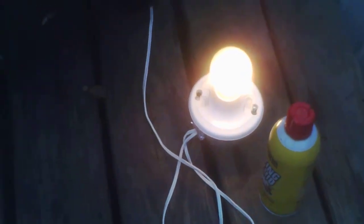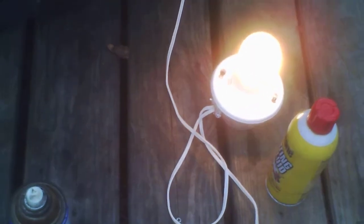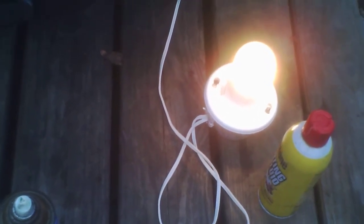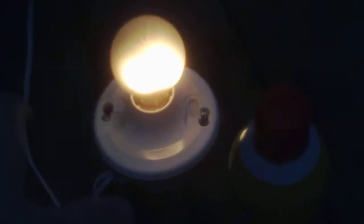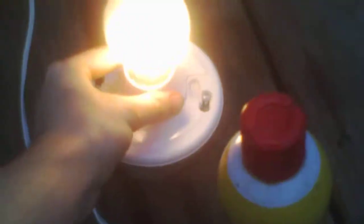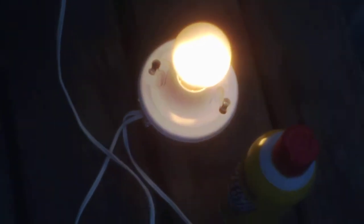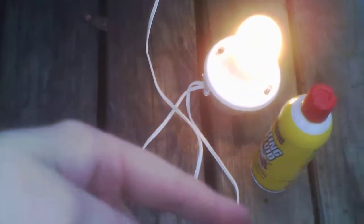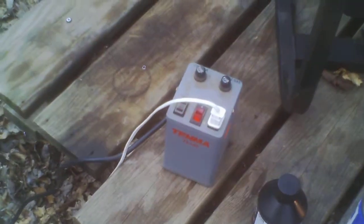The reason why you should probably never make one of these is due to its electrical design. The battery is connected to the DC side of a Graetz bridge rectifier. The AC side — one leg of which is wired in series with the lamp holder on top of the device, which is just a standard four and a half inch octagon box. One of the legs is wired in series with the lamp holder, and the other side of the lamp holder and the other side of the Graetz bridge are connected directly to mains electricity.